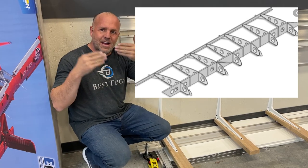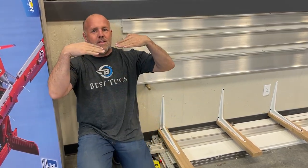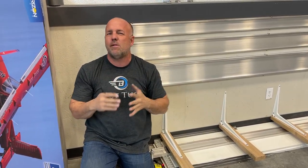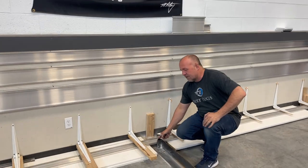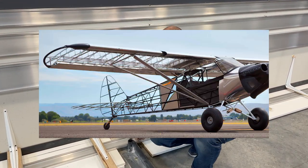These spars, if I tried to bend it and it wasn't pinched in something, as soon as I started to bend it, it would just start to bend and then it would bow up. And once it did that, we wouldn't have any real measurement. This mark right here is where it's gonna fold against. This is at 112 inches, representing the connection point of a wing strut.